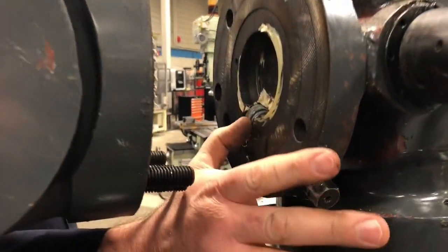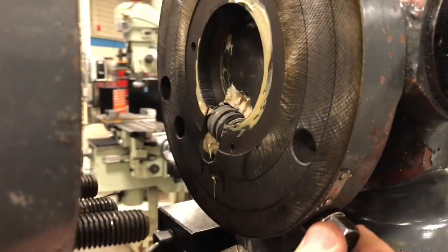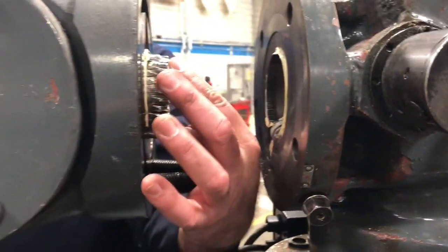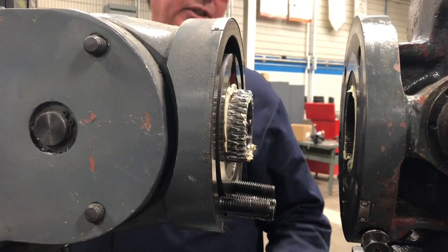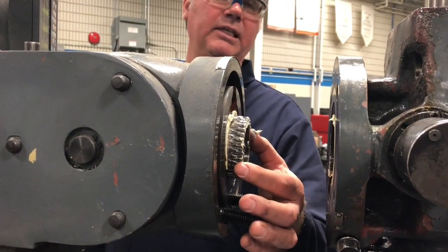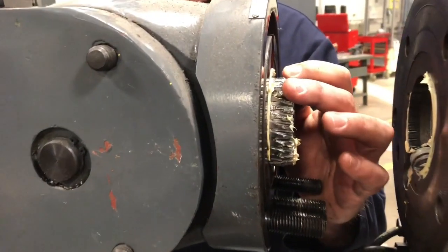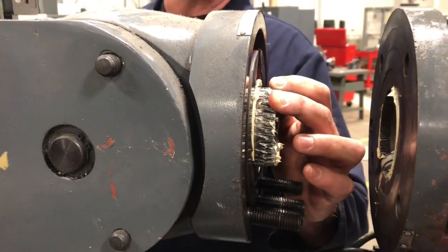This is the worm — the worm is on a shaft. You make the adjustment by turning this hex, and then that climbs this gear back and forth, so you can micro-adjust the verticalness of your spindle. But with the gear damaged, there's way too much backlash in the head, so you can't actually dial it in for straightness.